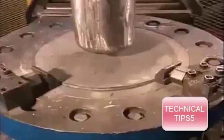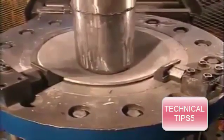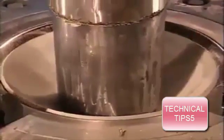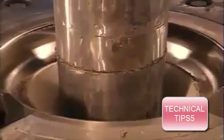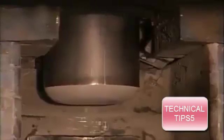After a quick drying period, each disc moves over a die. This process is known as deep drawing because a series of machines will gradually draw out the disc to the shape of a cylinder. A mandrel press begins stretching the metal, applying up to 800 tons of force — the weight of two fully loaded jumbo jets. Shaping the cylinder from just one piece of metal means it'll be seamless, and that's a key safety feature.